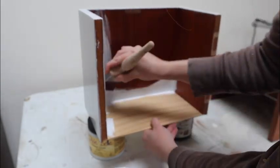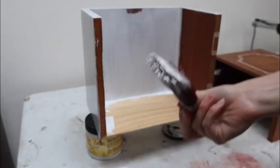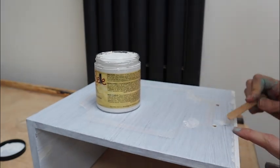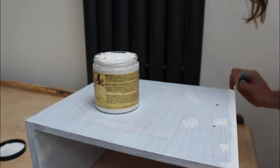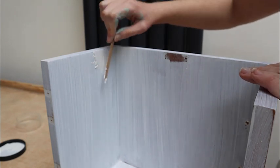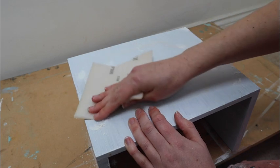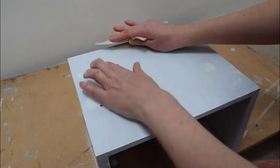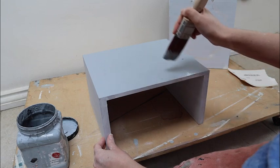Often a coat of paint will show up more flaws than you could see originally, and that was the case with the Slick Stick. So I did another round of wood filler — this time I used Dixie Mud in white — and filled in a few more nail holes and did a second coat on the edge where the trim had slightly ripped down to the board underneath. Because there were quite a few different materials going on — the veneer, the different base on the doors, the wood filler — I did a coat of primer to give an even surface for the next layer of paint.